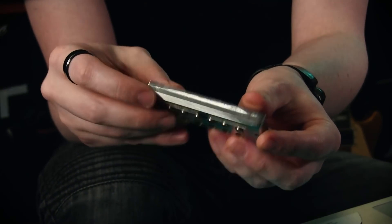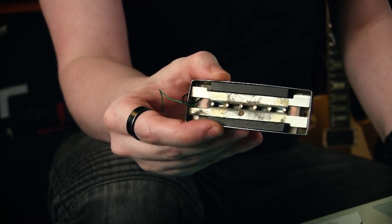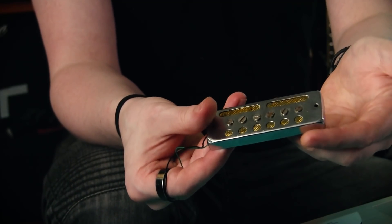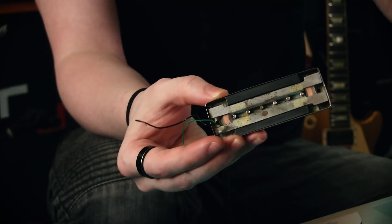These magnets should be arranged in the same fashion we see them in a P90, with like poles facing each other - north to north or south to south - so that the pole pieces have a very defined magnetic direction. However, if these magnets have fallen out or been taken out and then put back in without considering the correct magnetic orientation, that would in theory produce the sort of sounds Ryan has been getting: a very thin, almost out-of-phase sound. Without a strong defined magnetic direction for the pole pieces you'd get a very weak signal, and if you've got two magnets conflicting with each other, the current induced in the coil may conflict with itself, giving those oscillations we're hearing.